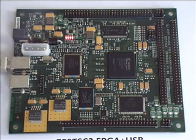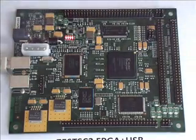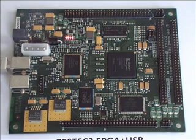I/O rich, the ZestSC2 is fitted with 4 64-pin headers for ribbon cable or to connect to a daughter card, 2 headers with 49 pins and 2 with 51 pins that provides 200 header pins of I/O to the user. 13 LEDs are provided on the board, 8 connected to the I/O pins, 4 for power indication that you can see here, and 1 for the FPGA done signal.